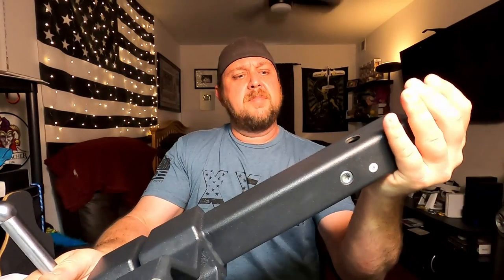One other thing: it's made out of ductile iron. Ductile iron is a higher grade of cast iron — it's got a slightly different recipe than what you'd see in a motor housing, where it doesn't need to support much. Then you've got pig iron, which you mostly see in counterweights and such — just scrap steel melted down and poured into a mold. This is nicer than that.